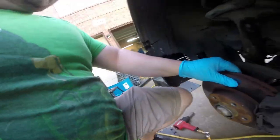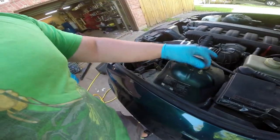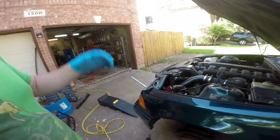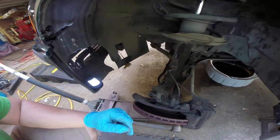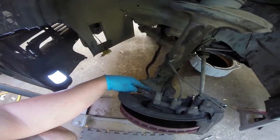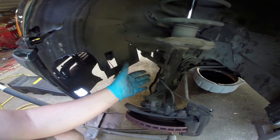There's one bolt right here that goes through — you take the nut off the back and unscrew the bolt. Then there are two matching bolts here and here that also have to be removed. Once those are out, you can knock this whole rotor assembly off, come up here and remove these three nuts, and the whole assembly will come out. There's no reason not to use impact tools, but I prefer to take this apart by hand when possible. Once you've got all six bolts out, there's a locating pin right here.